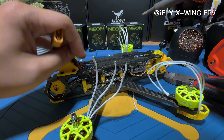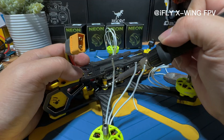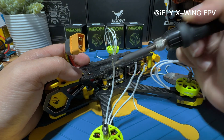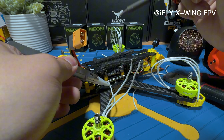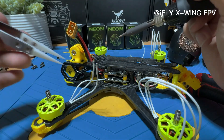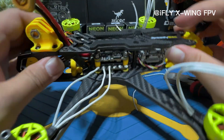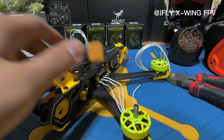The next step is to solder the wires to the pads. Let's prep the pads a little bit first because after removal they're kind of uneven — just put the iron on them to soften and reshape the solder. This should be good enough. Let's start soldering these motor cables onto the ESC. This should be an okay job — that's how you do the first one, and I'll finish the rest off-screen.